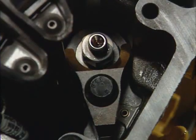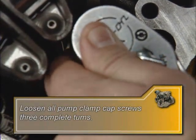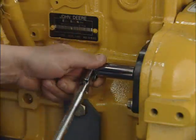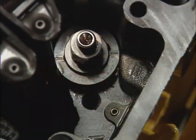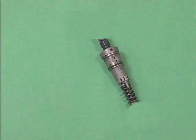Now you must remove the injection pumps. Loosen all pump clamp cap screws three complete turns and leave the clamps in place for now. Slowly rotate the crankshaft to push the pumps past the O-rings. As soon as each pump rises, remove the injection pump clamp. Remove the pump carefully, making sure you do not rotate it in the process. Place each pump on a clean bench and mark its location so it can be returned to the same position. The pump clamp screws can be discarded at this point.